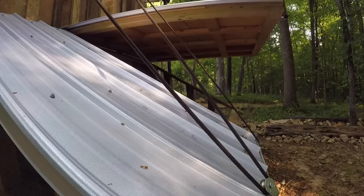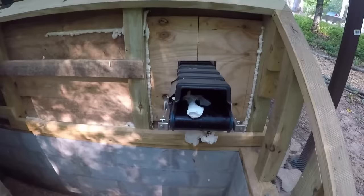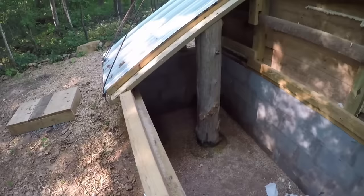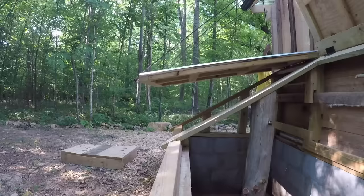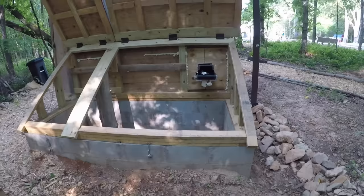The purpose of the decomposition chamber is to collect the solids that are dry flushed out of the toilet. As you can tell, the waste is predominantly toilet paper. The feces dry out quickly, lose their smell, and are broken down by soil microbes that can access the chamber through the earthen floor. The solids will decrease to about 25% of their original volume during decomposition. This chamber is 4 feet wide, 8 feet long, and 4 feet high, and has enough volume that we will not have to empty it for at least 50 years.